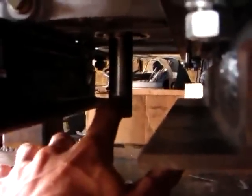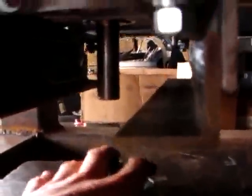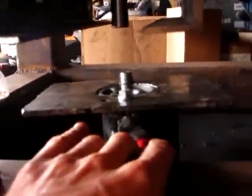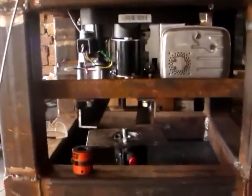So we need a 1/2 inch gap to allow for the spider between the two, which I've measured by holding this up and putting a little mark. See the little black mark on the shaft? That's how high this comes up. So we're going to take the motor out and then cut the shaft down to 1/2 inch above that black mark somewhere here, and then mount this whole structure together, drop the motor back in, and we're nearly ready. Stick it on the back of the tractor and pump some hydraulic fluid.